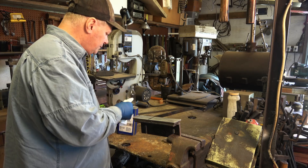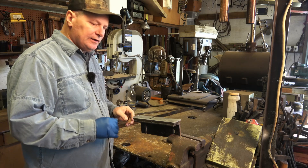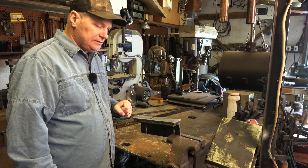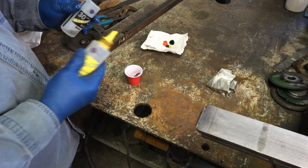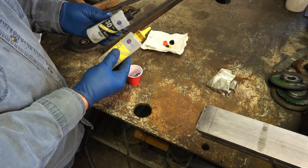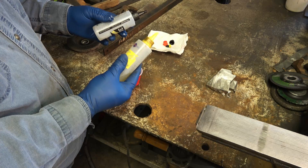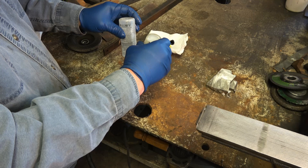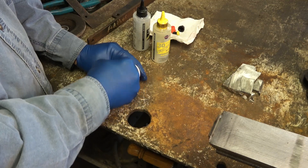It's still kind of warm, but it's all right. I'll get the glass platen and clean it up the same way. With everything cleaned up, I'm going to mix up some epoxy. I use a 30-minute cure — this is just some from POP. They don't sponsor me, but I use it on my knives and I use it on these. Something like G-Flex or anything like that should work. I like the long-cure stuff so I have time to work with it, and it does a great job.